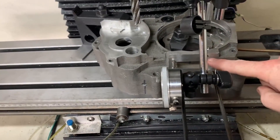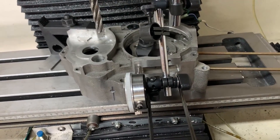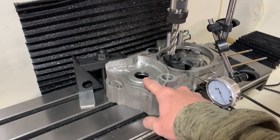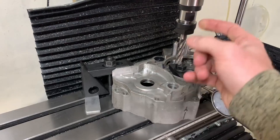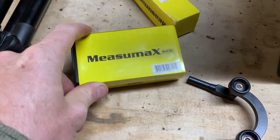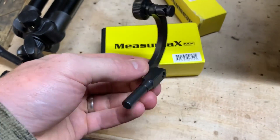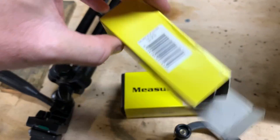I'd say that's good enough — I've got less than 20 microns deviation across this surface, so that will be sweet. Next we're going to use the test indicator to indicate this. I've got a little coaxial attachment thing, which should be pretty cool to use for the first time. For my birthday I bought myself a budget DTI and this coaxial, or half-round, dial indicator holder.